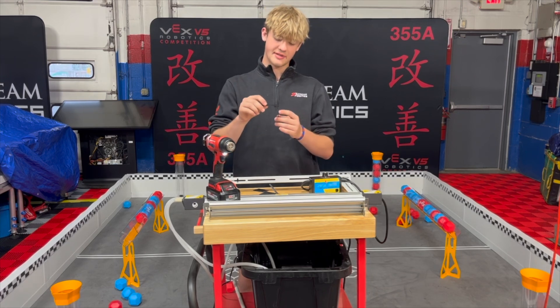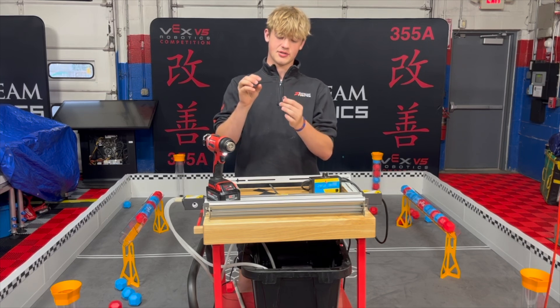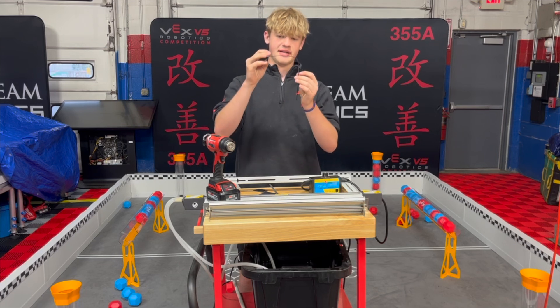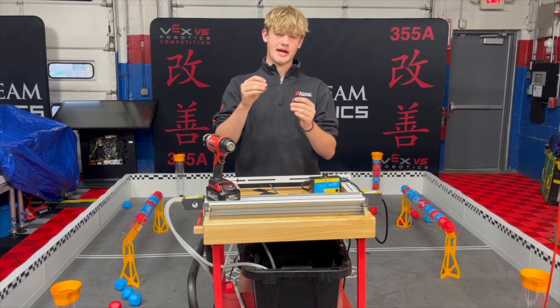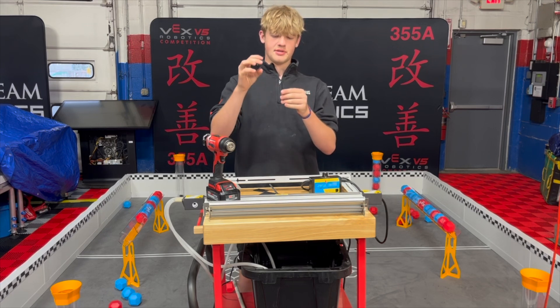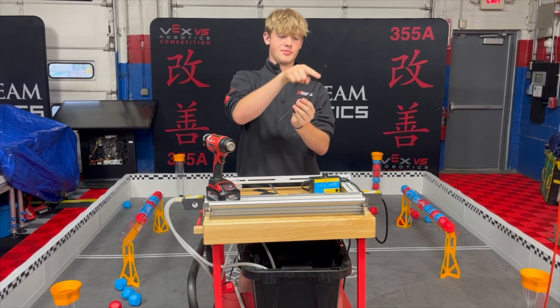So now that it's softened up, I want to hold it at this position and let it cool. As it cools, it's likely going to come back from the position I'm holding it a little bit and return to more of a shape like this. With the heat gun, we found that you usually have to go over it a few times to really get that position to hold. But after just a little bit of time, you can see that this piece is now a 45 degree bend with a nice smooth curve to it.